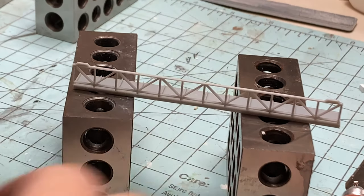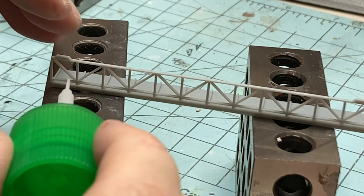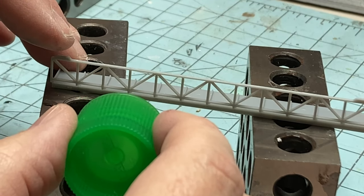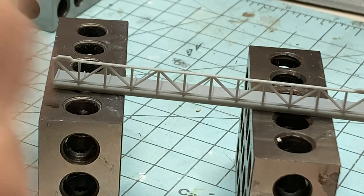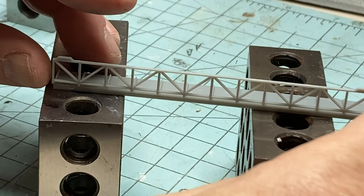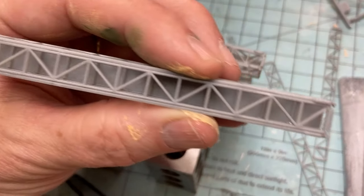The next part to be aware of are the little protrusions on the upper side of part number 52. Those need to be built in such a way that they're to the inside of the conveyor that you're building — the square, if you will. Since I built mine upside down, the last clue for you is that the thick flanges on parts number 52 need to go to the top side of the build. All this will help you get the correct orientation for the parts the first time.